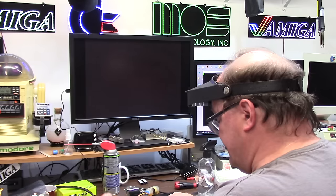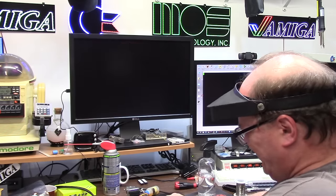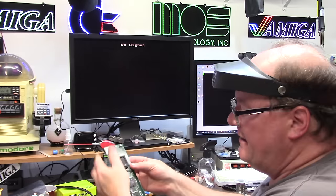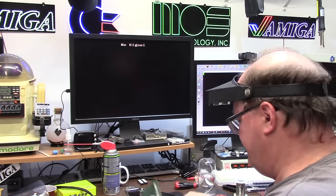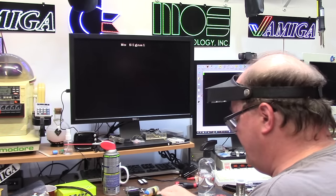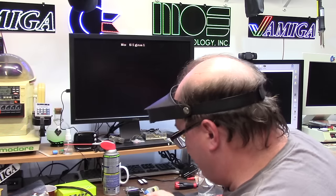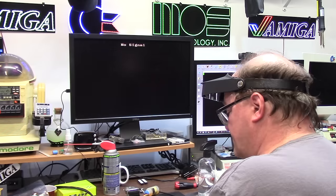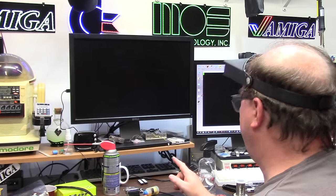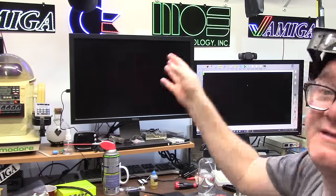So I have to check clock pins and all that good stuff, and that's really fun when you're upside down on an accelerator board like this. You know, because you can't get to this side. So that's where I'm at. We got new crystals. I remember putting those in. They're socketed. New caps. ROM speed. Three replacement. Well, one replacement GAL. Two verified programmed GALs. And not a nothing on serial. And that's that for tonight.